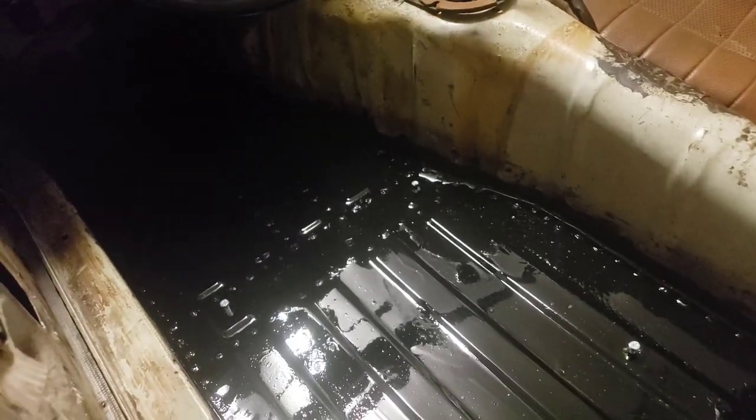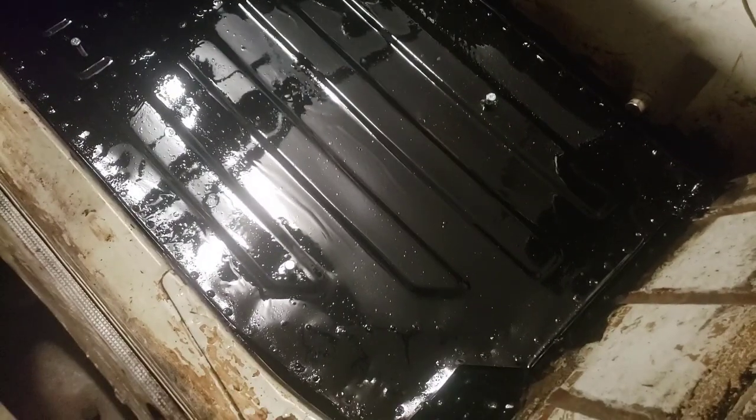And so you'll see in part of the video, I started having the welds breaking. As soon as they cooled down, they just pop off from the tension. So I turned the heat up a bit, and it worked great. But we'll talk about it more in a second. The set point that worked basically was max voltage, speed 4, and I used Vulcan 0.03-inch wire. Here she is, all POR'd in and ready to go.